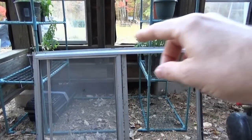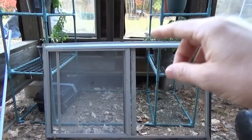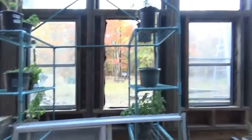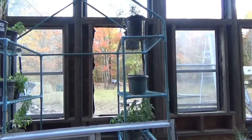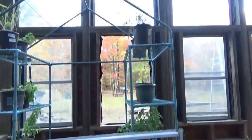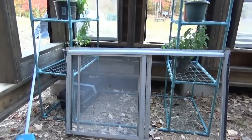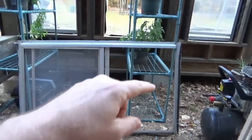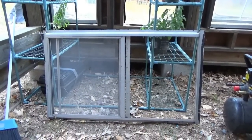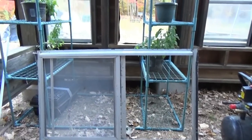And then I put a bead of silicone all the way around the frame. And then, well, first of all, actually, I fit it into the frame. Make sure it fits before I do any of that. And then I do all the rest. And then I pop it in and then screw it in. I have to drill 4 holes. Each window is taking 10 screws total. I have to drill 2 holes in the top and in the bottom because there are no holes for framing it on those ends for some reason.